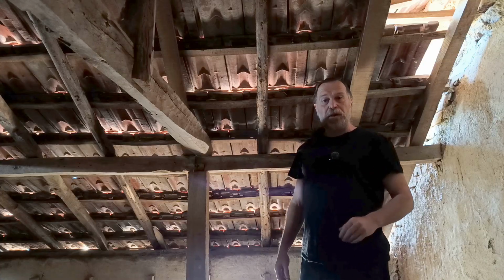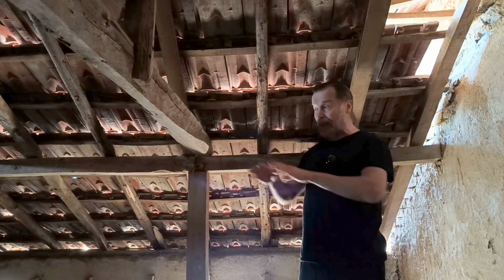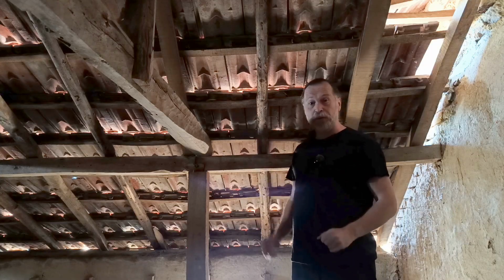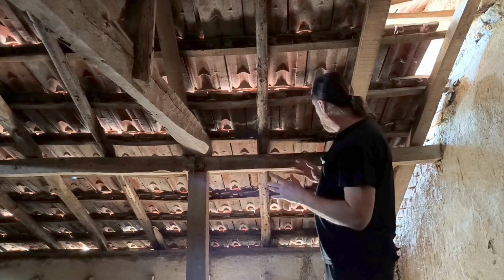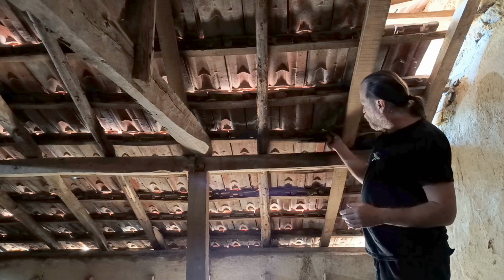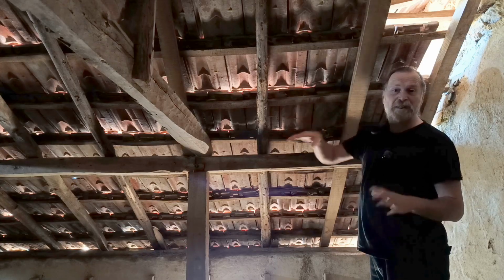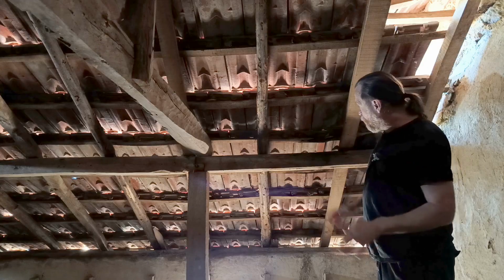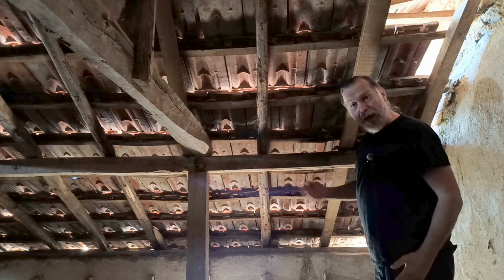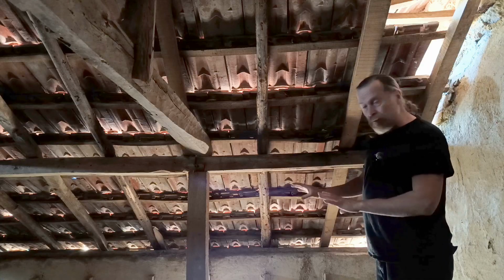Another job we're going to do this week, which you know about because we came up here to sort out the leaks and then ended up tidying the whole of this attic area, is the leaks in the roof. Now this is the worst bit behind me. We've got rotted timber here. It's propped up on jar lids. You can see daylight through. That's normal, that's not a problem. But we did find that all along this line here, whenever it rained, we got water coming through. So we've got a bit over there as well, but I'll come to that when I come to it.